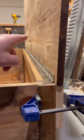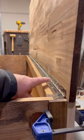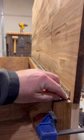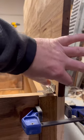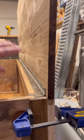Do the same thing at the other end. You always want to attach the piano hinge to the box side first, where you want it. Again, use the square to get it on the back so there's no binding. Then you can clamp the lid to this hinge and screw them on.